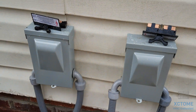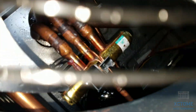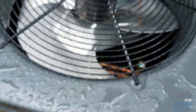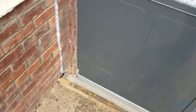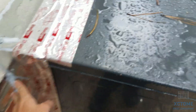There's the two disconnects and my camera light is on but that's alright because it is a little dark out here. Here's what the unit looks like — down inside it we have a Copeland scroll tucked away in the back corner and a US Motors fan motor. Something I've never seen on a Goodman before is the swept wing fan blades. The install took all day because we had to do duct work under the house, and we were unable to put it zero clearance, but this is considered zero clearance because it's less than two inches off the house.